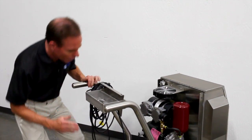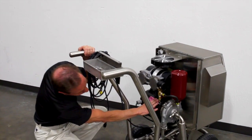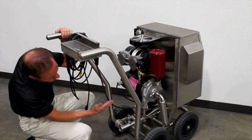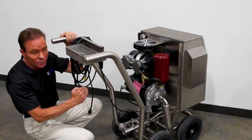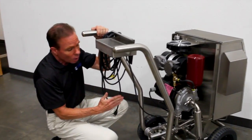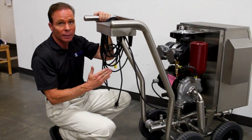On the bottom of the cart we have the pump. The pump is required to generate the suction through the injector so that we can take the gas phase ozone, inject it into the water, dissolve it, and then deliver it straight to the application.